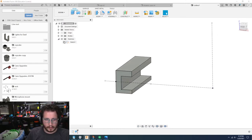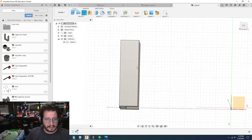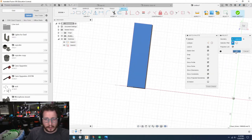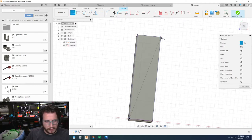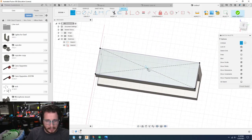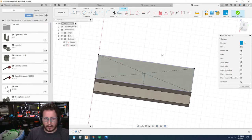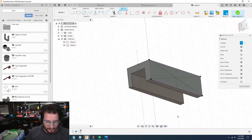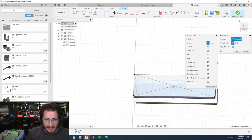We're going to do a little bit more and that's going to involve some sketches from up top. Let's get a sketch tool, grab the top section, and hit P for project. We're going to project that top surface — that lets us know where things are. L and X. This will help us pick up our center. And now we have our direct center. That's important to us because we want to make sure that everything we're doing is across the center. I want to make an ability for her to have a screw. Let's make the hole five millimeters — that should be fine. I need to pick up where that edge is as well.